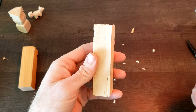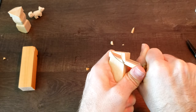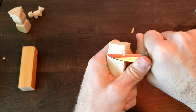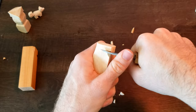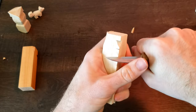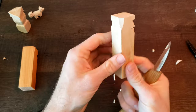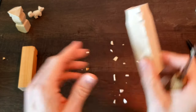But now let's try it with a sharp knife and see what we got. Right away this makes a difference, even in the non-soaked basswood — it's just a cleaner cut overall. Instead of splintering apart and breaking off towards the end of the wood, it's a much smoother cut. And that's the benefit of sharpening your knives, in case you needed another reason to do it. But here's what we're left with — just a couple of notches.